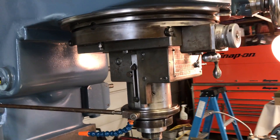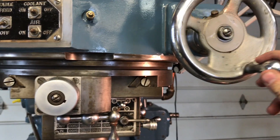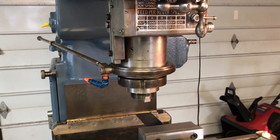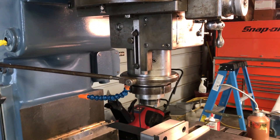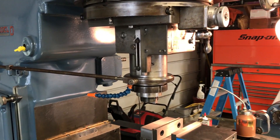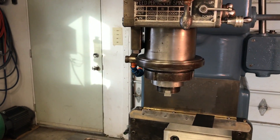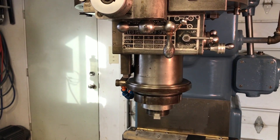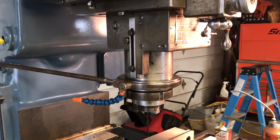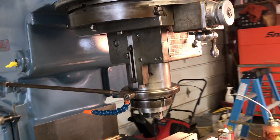The key feature of this machine — what it's known for — is the rotary head. This is the hand feed handle here, and it will spin the spindle housing in a circle. You can offset the spindle from the centerline just about twenty thousandths over four inches, so you can turn about an eight-inch circle with the rotary head, which is pretty handy. I don't think I'll use it up to that size very much, but for radius corners — internal and external — or making circular shapes it'll be really handy, or for boring holes where you don't always have to have the right size end mill.